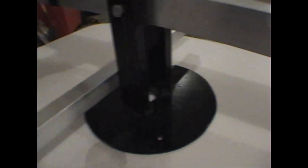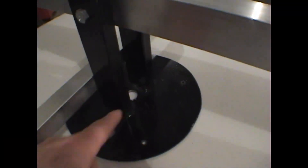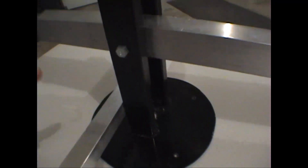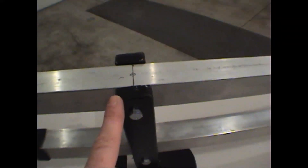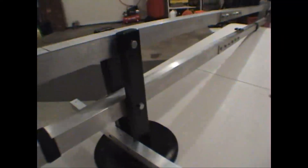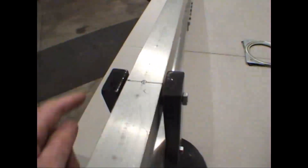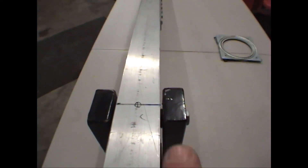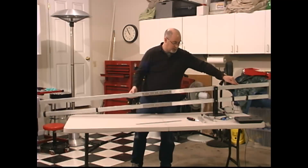There are two pieces in this tower and I did weld — this is the only welding part on here. You need to make sure it is cut very straight. This is one and a half inch by three quarter inch hollow steel. I found some little plate steel, put it on top, welded that, and then trimmed it off really nice and painted it black. You do have to make it the width of these two pieces here. You can kind of see the thrust bearing down in there, and that's what allows it to move up and down.